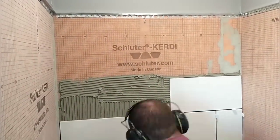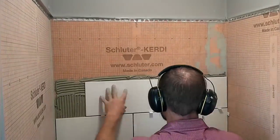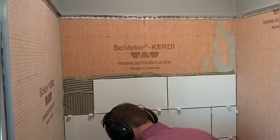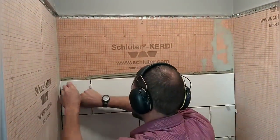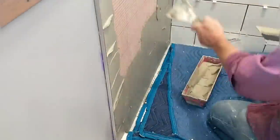I was able to do this entire wall in one session. I was at first concerned that the upper tiles would cause the lower tiles to shift as everything tries to sag before the mortar sets, but that wasn't a problem. I think it helped that the tiles were larger and I used plenty of pre-made shims. It wasn't an issue — I was able to do it all in one go.